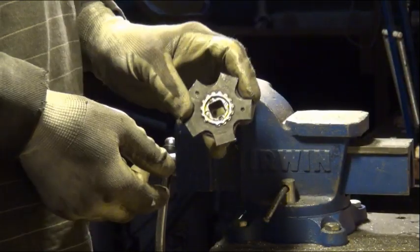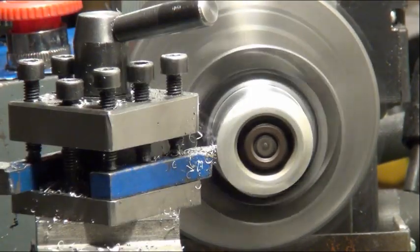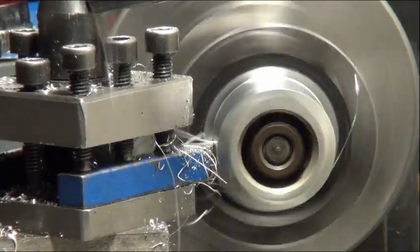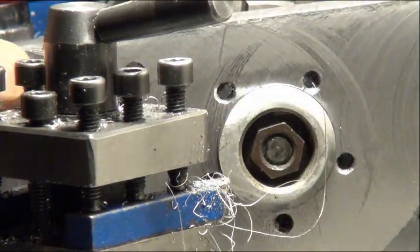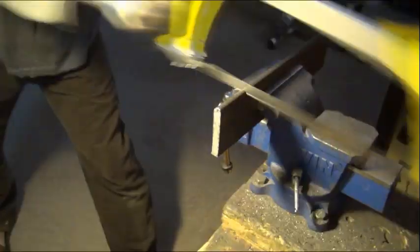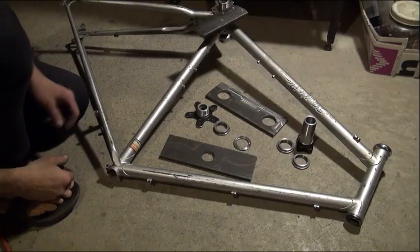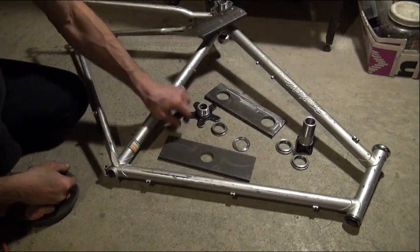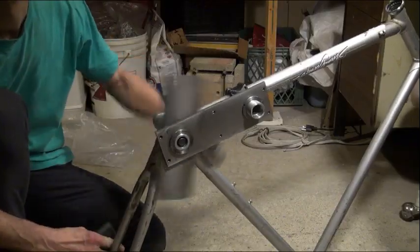First I made a one-sided spinning blade to run against a fixed blade. Then I realized that single blade was unbalanced and not braced well, so I went for a two-ended blade and started over with a new crank from which I extracted another spider. I ran this through the lathe to cut it down to size and add threading so it would hold things together. This fit nicely into the new two-ended spinning blades. Here are all the shiny parts: bushings, lock rings, the support post and spider, the fixed blade with two holes and spinning blade with one.